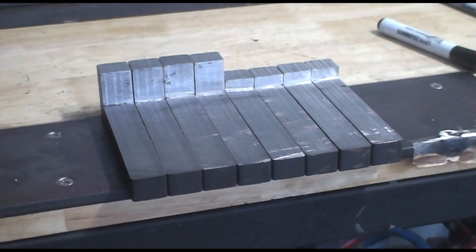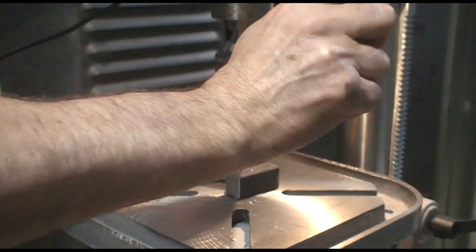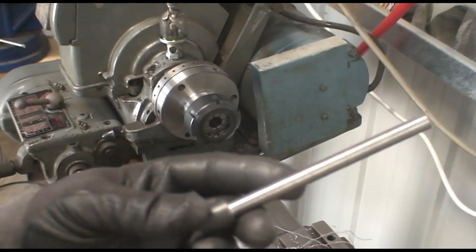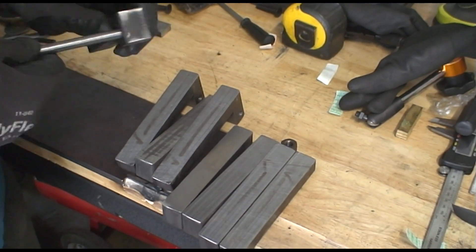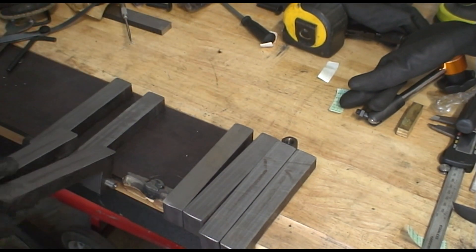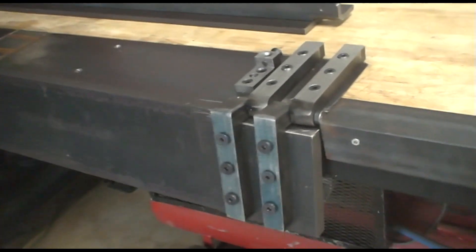What I've done here is replaced the 25mm steel with 20mm. This reduces the weight a bit, and I was able to use the 25mm to make my hinges. What everyone needs — a small lathe to make the hinge pins and other stuff. And here it is: the insane metal folder for under 300 bucks and no welding.